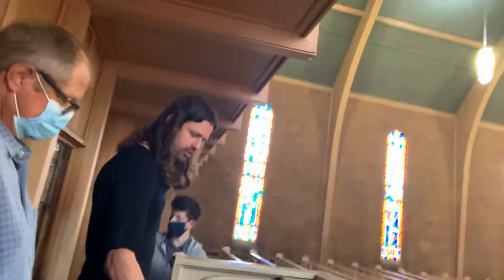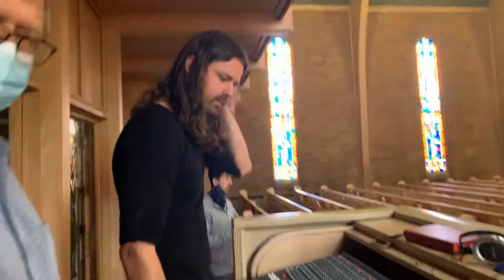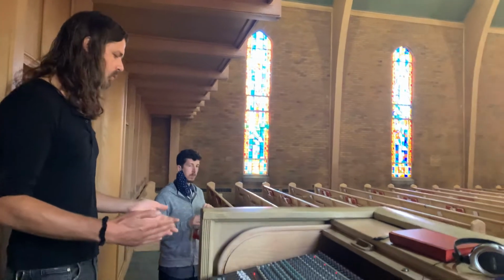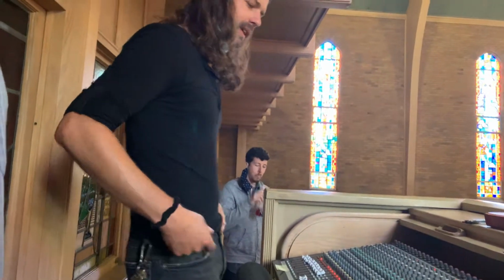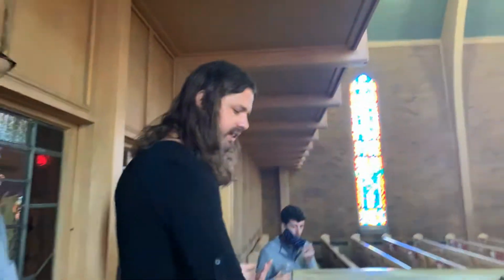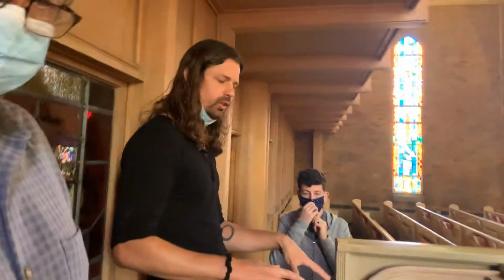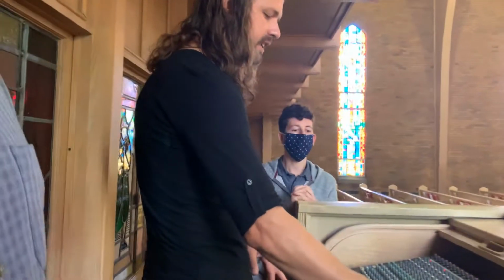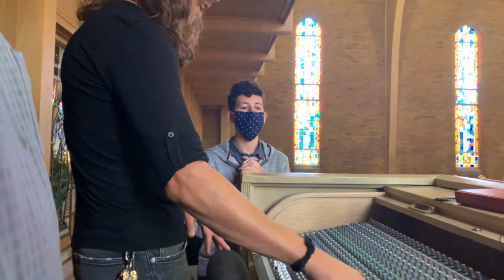So if that's the video channel here, right? Yeah. I'm gonna have to turn on the computer. That's fine. So I'll show you what I consider to be a proper input level on a board like this. It's pretty easy though. Usually, on an old analog board like this, digital boards are a little bit different, but on a board like this, I'd probably leave it between -6 and 0, or even -12 and -3.